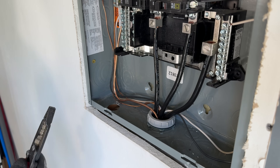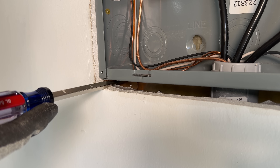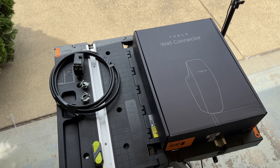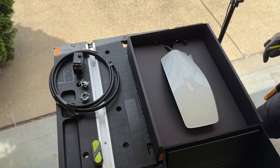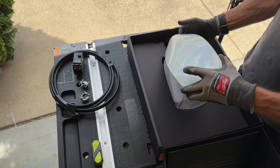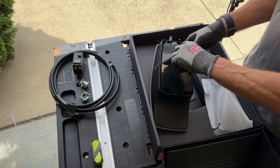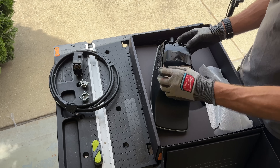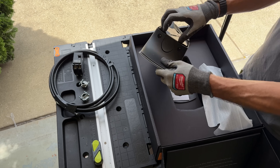You can see the wall stud on the left-hand side of the sub panel — that's also where I'll be mounting the connector wall plate. Opening up the wall connector, you have the main unit with the cord attached, and on the back side you'll find the mounting plate with the screw terminals. That's the piece you need to get out, mount on the wall, and wire up.